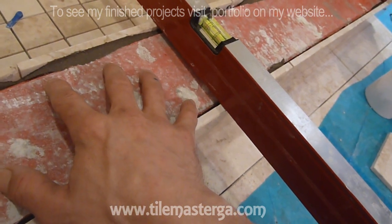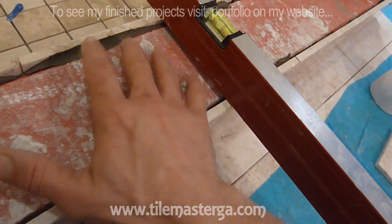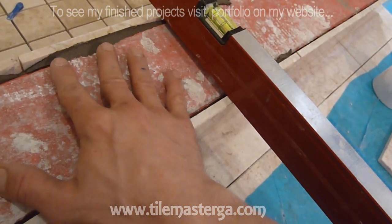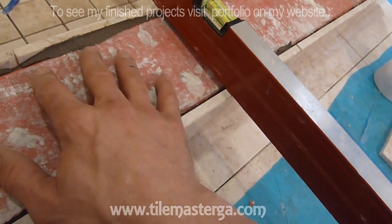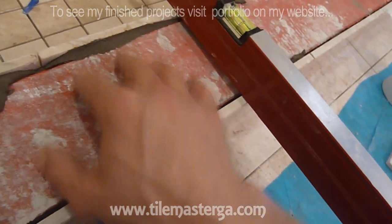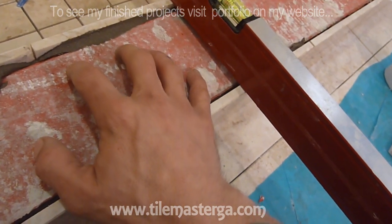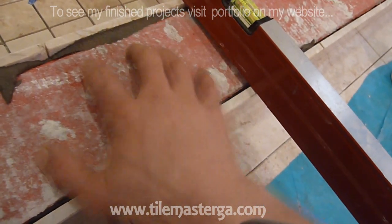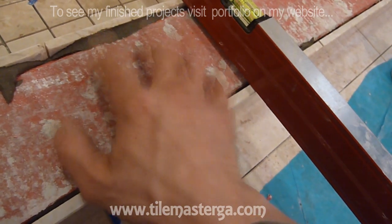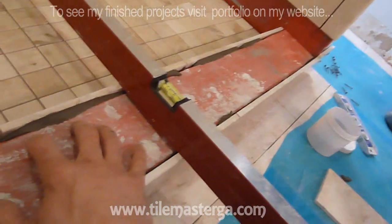It's very well waterproofed, but having that additional quarter or more or less of the thin set also prevents it if water gets under the grout for whatever reason over time. It will meet with a thin set, the dry thin set, which also waterproofs at some point, and our membrane. So there's no option for water to do any damage to the curb and everything that's been waterproofed.